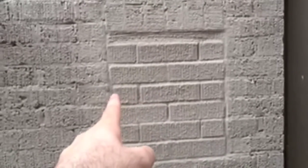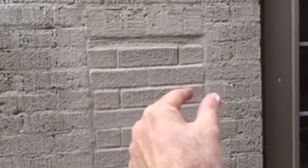So there's two options to do this. One way would be a straight fill such as this, where anywhere you have to fill in brick, you just take the edges of where you've had your previous cut or where the previous opening was, and you just fill in as much brick as you need side to side. If you have a half course of brick here, you just cut the brick in half, cut the brick in half over here, and fill it. So you have edge to edge, but you can see a very clear indication of where the opening once was.